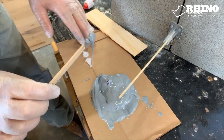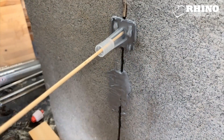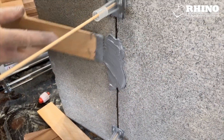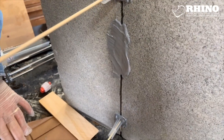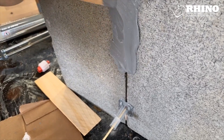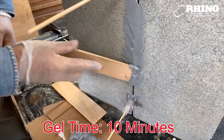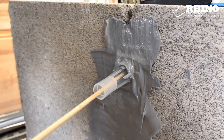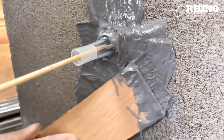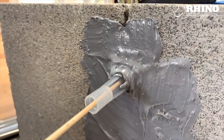More anchoring paste now goes on the crack. The purpose of this is to contain the epoxy that we'll be injecting later — that's different stuff than this and we need to contain it, otherwise it's not going to fill the crack. It's just going to ooze out. We don't need to go very deep with this; we're just creating a sealing skin over things. You want to go over the lip of these injection ports because you don't want that to leak. We want it completely sealed in.